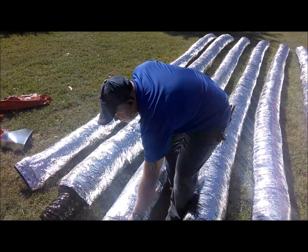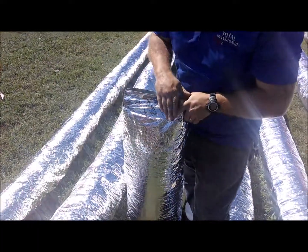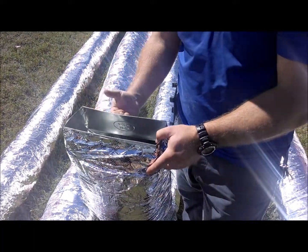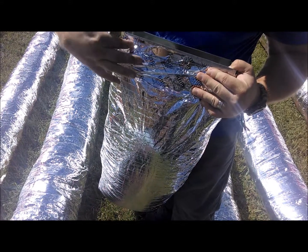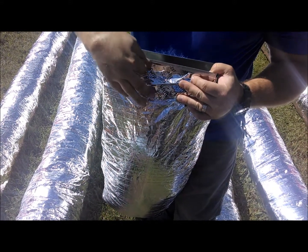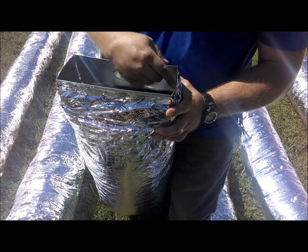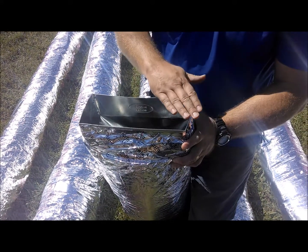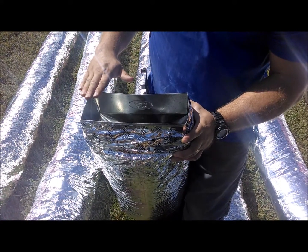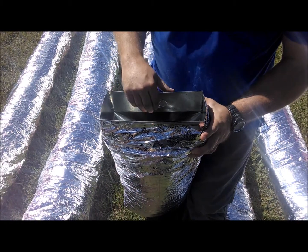This homeowner is going to really love the fact that their utility bills are going to be down considerably. Then also, when you look at the boot itself, this is one that's been done already. You can see where it's got flex fit tape all around the outside. It's nice and well insulated all the way to the 1-inch gap right here. We got a 1-inch floor, and where that little lip is, that's just going to slide right up into the floor. They'll nail those in, and then what they'll do is they'll go in and they'll put a sealant, some duct butter or mastic over the top of that, and they'll make sure that floor is sealed nice and tight to where there's no humidity coming up through the crawl space and into the living space.